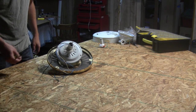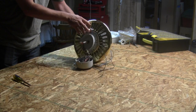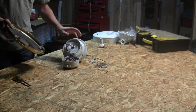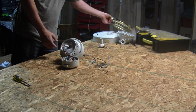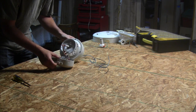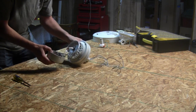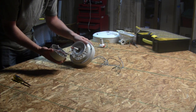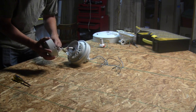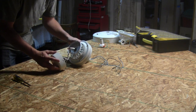It comes off piece by piece; it's not really hard to figure out. All ceiling fans are slightly different but very similar, so just keep removing pieces until you get down to the motor unit — that's really what we're after. Take all these wires out of this housing unit and disconnect everything. Don't cut any of these wires yet — just remove them and we'll go from there.